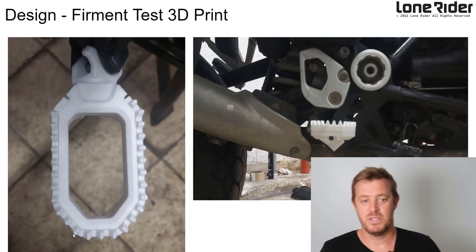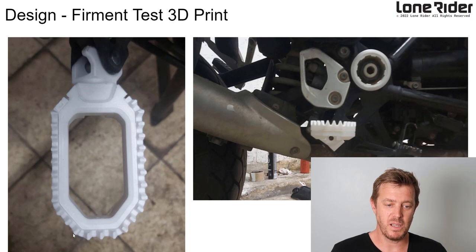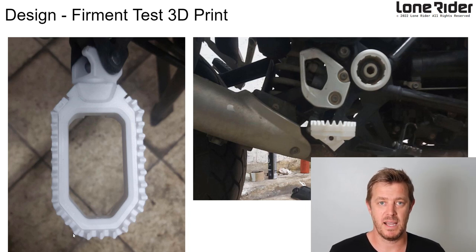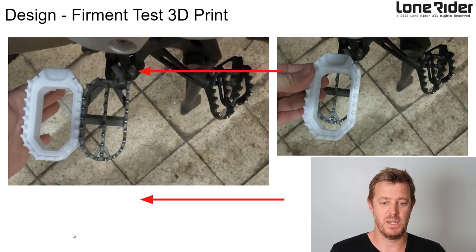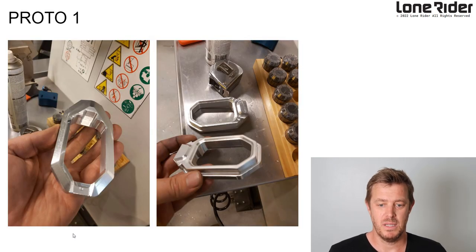We started 3D printing — we had to do a final couple of prints before going into the hard models. We did a lot of testing before CNC'ing it out of aluminium, just to make sure everything works perfectly for ride tests, because with 3D printing you can't actually stand on it. There were a few minor adjustments, like one change that reduced material by about 15%, which is a huge cost saving we can pass on. Then we started with aluminium on a 5-axis CNC machine and built a working prototype.